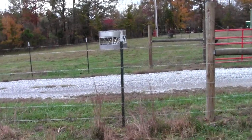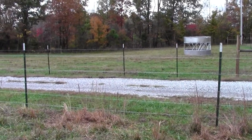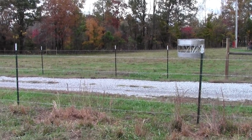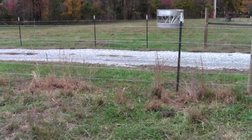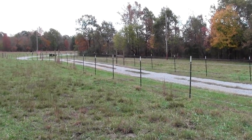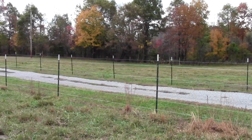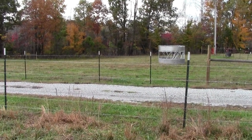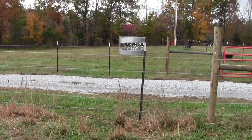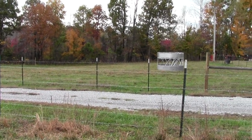Now, T-post spacing. I did mine a little closer there off my initial brace post — that was just where it was, so I nailed it in. But between my two posts, I did 12 feet. One of my T-posts is six foot long, so I laid a T-post down twice and got 12 feet — that was an easy way to measure since I always had a T-post handy. So 12-foot spacing is what I did. They all look 12 feet apart and symmetrical. Over there across the driveway it was a little more than 12 feet between my brace and the first one, so I just stuck one in the middle.